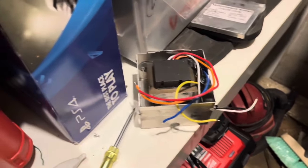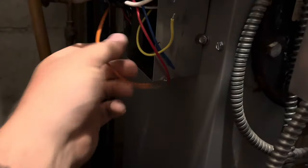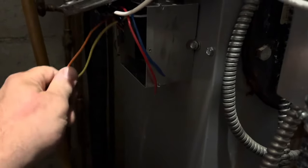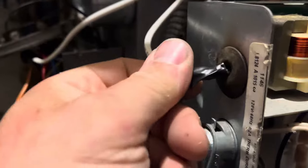I think this will work out pretty well. I have my transformer mounted with my line voltage coming in. We're going to tap into this line voltage. I'll take the 24-volt side to the relay on the coil side, and then the relay on the normally open side will go over to TT. We're going to remove this TT right here and tie it in over there.